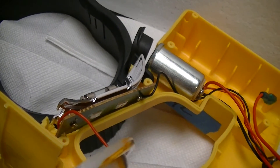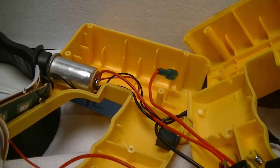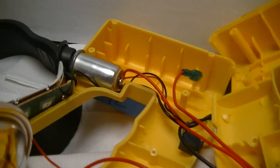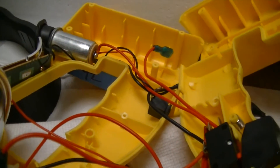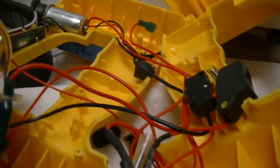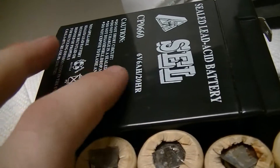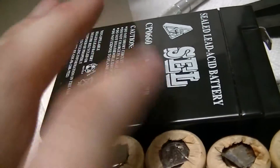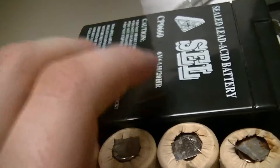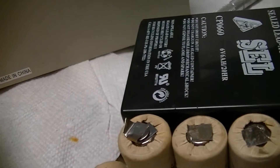I'm going to try and keep this as stock as possible, just for historical reasons, although I'm obviously going to put in better batteries. The NiCad batteries I'm going to build have much higher current handling capabilities and can handle being on a trickle charge for extended periods. The original batteries are marked as being 6 ampere hours, even though they're the size of a 4 ampere hour battery. The common 17 ampere hour size battery you see in a lot of jump packs can actually get up to 22 ampere hours nowadays.